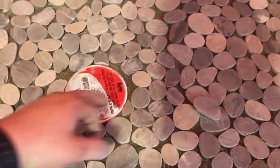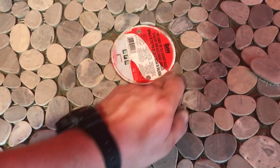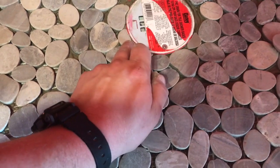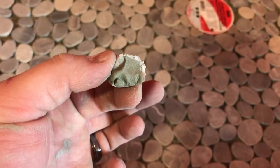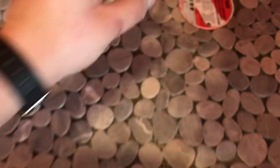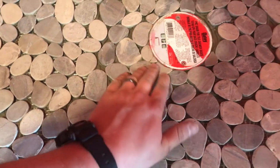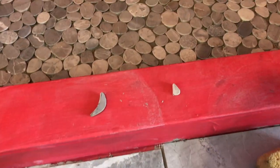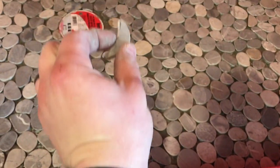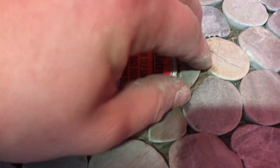Now I'm working on piecing in these holes around the perimeter. I want to get as much rock as possible around here so water drains and doesn't pool up in these areas. I use my grinder to shape them — you trace it over, put mortar on the back, use your grinder to shape them. Look at that. Make sure you take the sharp edges off so there are no sharp edges.